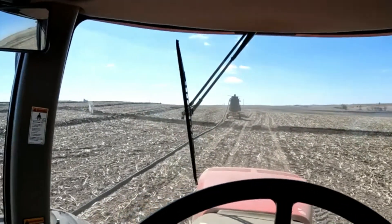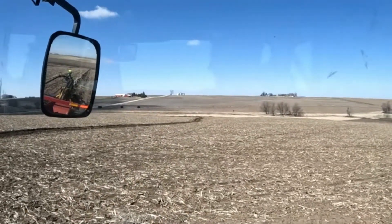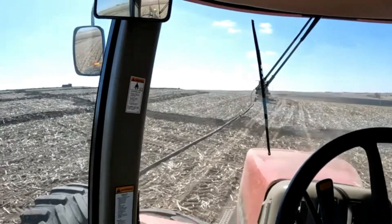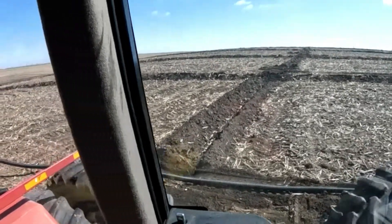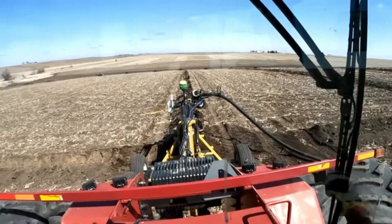We're about to cross one of our mains that we've put in. Down here the slope changes, so what we're going to do is plow right over the top of it. I know I'm higher than where the main is, so we won't hit it. Then we'll come back in, dig at that spot, and put a tee in after we've plowed over it. It makes stringing the tile so much faster and you don't have to dig as many holes — we're digging one hole for two connections instead of two holes. We'll stop further down, reset our monitor, and then keep going.